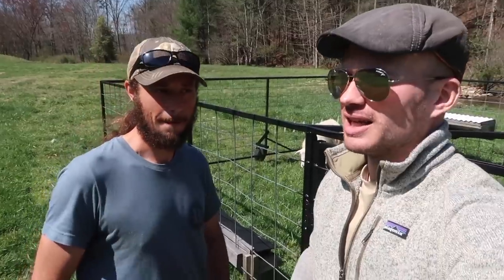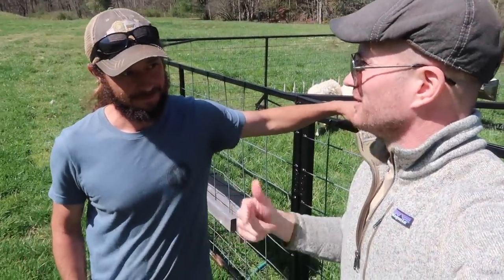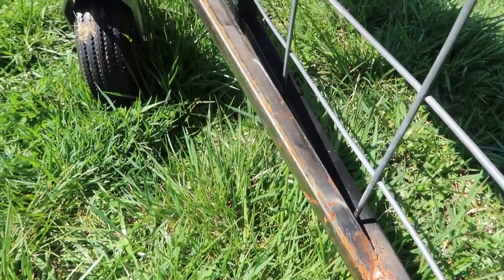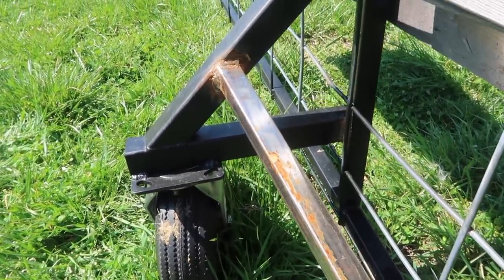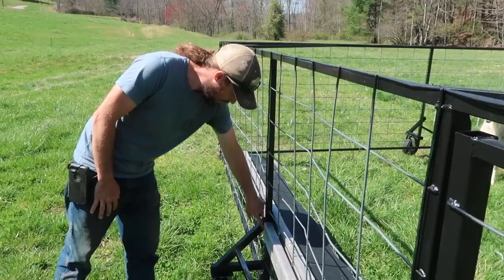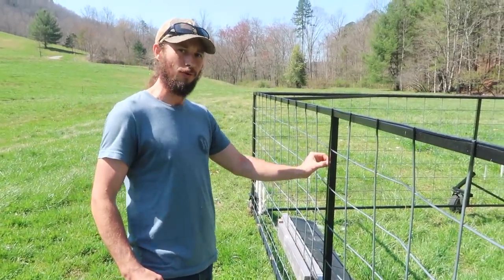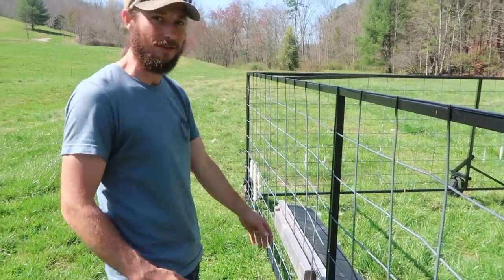It was probably about 2 weeks ago, I was editing the vlog you were in with Justin. You came out and welded these right here. Yeah, let's see what you did there. There's really no support side to side on these. And so if you hit a divot or a rock or something, all that stress is just right here on where the welds are. And what had happened was the welds had actually ripped out of the metal. And so there were big old holes right here that I had to fill.